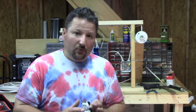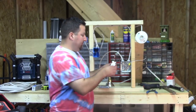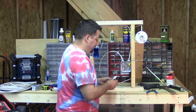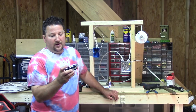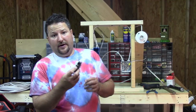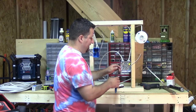That's why it's always, always, always important to check what you're working on and make sure it's dead — no power to it before you start sticking your fingers in it. You could shut one switch off and assume it's dead, but there could be 110 volts sitting on the bottom and it's going to zing you. So just a little safety tip. When wiring up an outlet: the bare wire goes to the green screw for ground, the silver-colored tab gets the neutral or common wire, and the gold screw gets the black power wire. I was going to use the outlet as a through-feed, but now I'm going to do a splice instead.